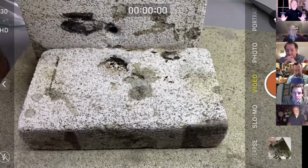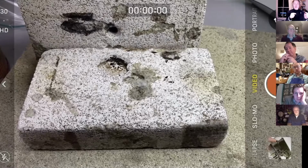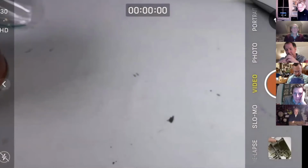Okay, so when you're hardening and you want it to be dead hard, take the flame with small components like that, take the flame to the water. You want the cooling to be absolutely as rapid as you can get. That little torch I've got in here is pretty underpowered.